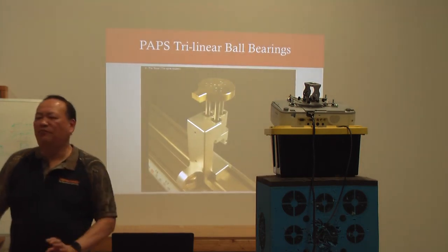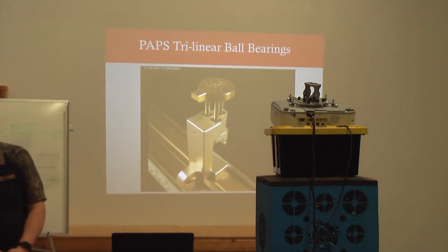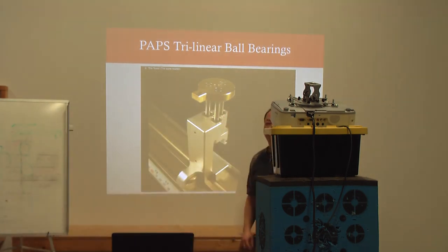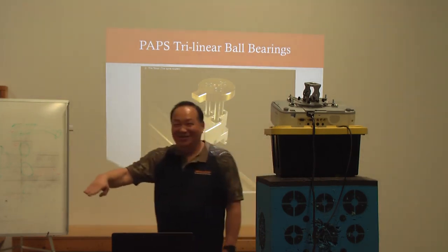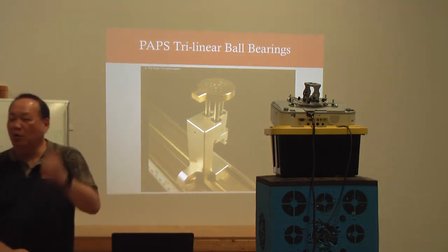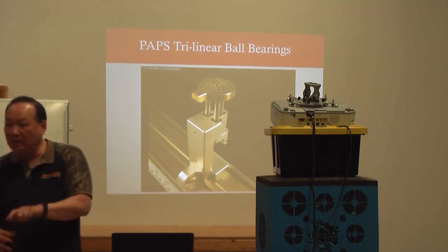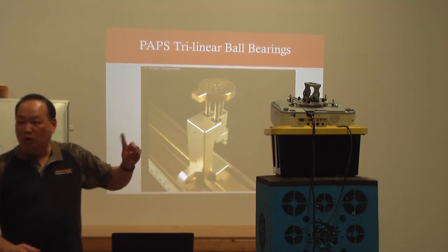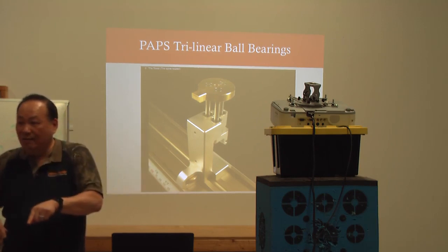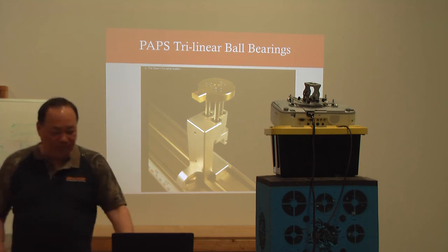Then I say, how do you know the force is indeed linear? If you look at the Aero APS system, see these three parts right here? Those are not bushings. Those are linear bearings. That means you've got three points on a linear bearing. What's going to happen with the vertical travel? It's within half thousandths, no matter which way you sway it. That means I can feel which way it's coming in. So all of a sudden, I've got six points because I've got six crown bearings touching it, pushing down. That is the best you can possibly do mechanically.